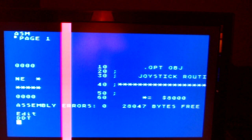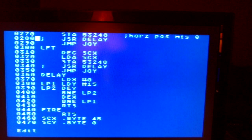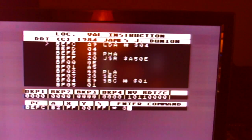Let's slow it down a little bit more and see what happens if we put the delay back in. We'll set it as low as we can get it. This one starts at 255. This is decrementing the X register, so it's going backwards. So probably set this one to 1. And this one maybe to something like 255. Let's see what that does. We'll just try that for purposes' sake, and see if we can get it to do anything weird.